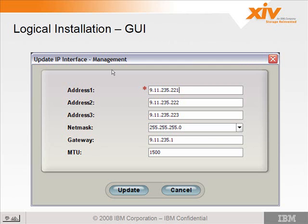Okay. There is no super user to... We get DS6000 calls all the time for that. It's an easy way to do that. We mentioned that there's two default accounts, the admin and the technician, right? There's also an additional two accounts: a development account and an XIV maintenance account. The XIV maintenance account allows you to have the admin and technician functionality together in one account, and the developer is like a super user. But those accounts are reserved for development for obvious reasons.